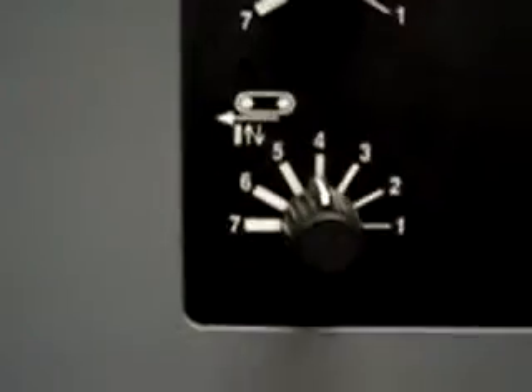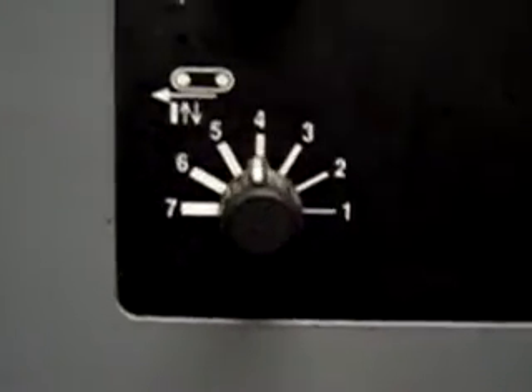If you look up inside of here, you can see the little white tab poking out behind that stainless steel piece — that is the sheet separator. This knob right here controls that sheet separator. It is going to separate the sheets depending on what you're putting in. Certain sets are going to need more sheet separation than others, same as certain sets are going to need more blow than others. You have to watch how much blow you give it because it can cause a problem with lighter sets. We're running it at 5 for this one and it's working properly.